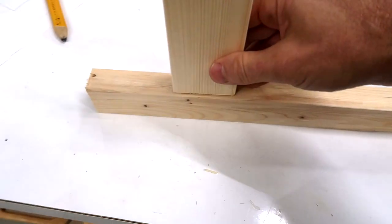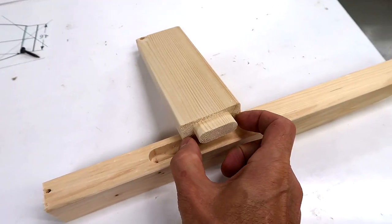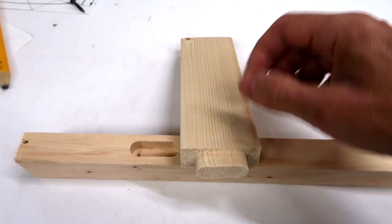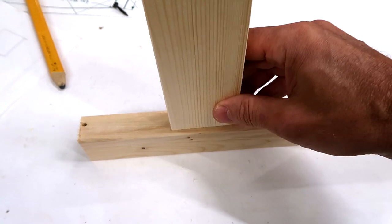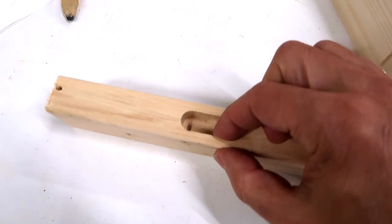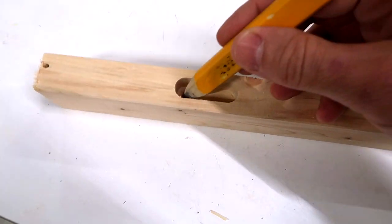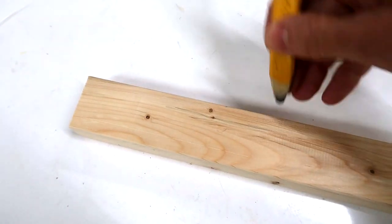I've seen some chair kits on YouTube recently where the mortise and tenon joints are thick and short — the tenon isn't even the full width of the piece on the end. The thickness doesn't really help; it's not like the tenon is going to rip off. But making it short means it doesn't go very far into the leg, so it just doesn't hold very long. And making this part thicker means more of the leg gets cut away, so when that gets stressed, this thin little part will just break off right where the tenon goes only that deep.